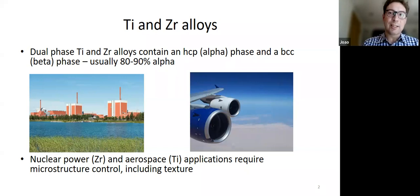And the beta is quite important because it helps you modify the microstructure, and it helps you tailor it for certain applications. So for example, even though we use titanium to make bits of wings on airplanes and bits of the engine in the airplane, the microstructure in the two places is quite different, for reasons to do with how the components are lifed. And it's that flexibility that gives titanium alloys like titanium 64 their popularity in aerospace.